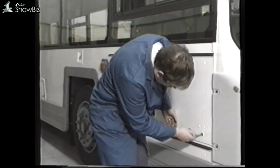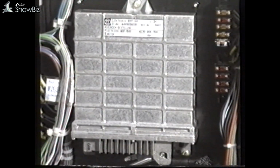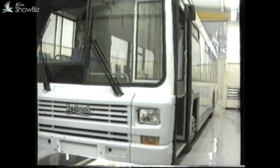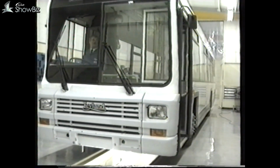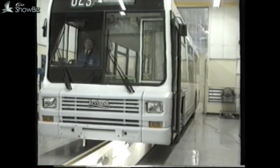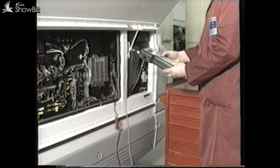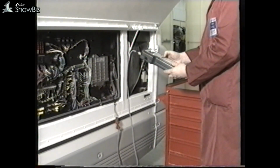The Mark II range has a more advanced control known as EST18. With this system, if the control panel detects transmission slip in drive or during gear changes, or a speed signal fault from the turbine sensor, the driver's selector switch lights will flash. In this condition, the vehicle must be rectified before returning to service.